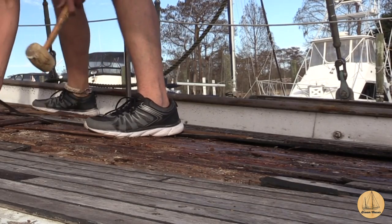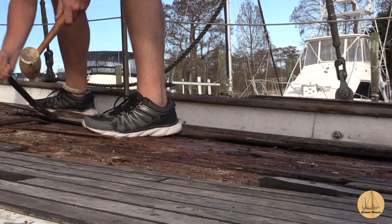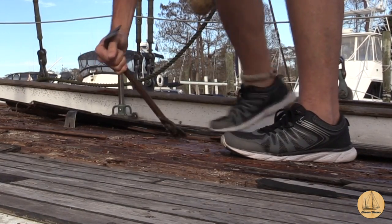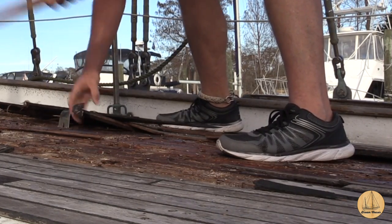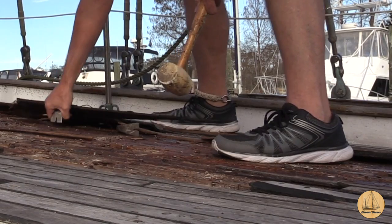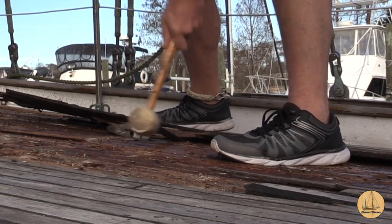I thought it'd be good to show exactly how we go about pulling up this teak deck. As you can see right here, I'm using two different crowbars. I have a flat bar — I started at this section of it, holding it with the beveled edge along the hull, and I'm just pushing it in. Then I use a thicker, longer crowbar and put it down as far as I can, go toward the part that's connected, and just start lifting up. I start to alternate — the decking broke right there, I find another spot. A lot of times these spots are right between where two of the screws were in the deck.